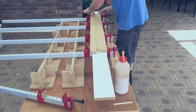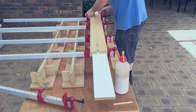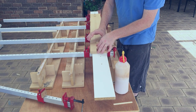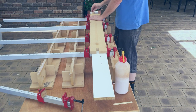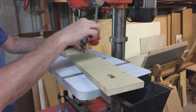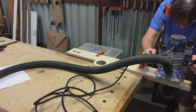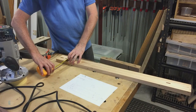This seemed like a good idea at the time but it should have been obvious that I was doing the wrong thing. I sanded the jig flat once the glue-up was complete and then trimmed the ends to length. Tight fitting moveable dowels are used to align the jig with the leg's reference surfaces. I tested the jig by creating a test leg. I discovered the glue-up mistake once I started to cut the first mortise and the guide bushings started to bind. I removed most of the friction by sanding away the extra glue.